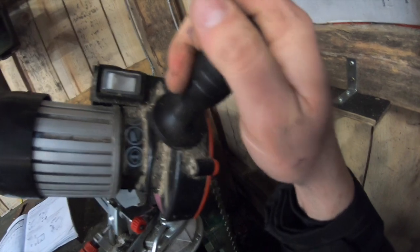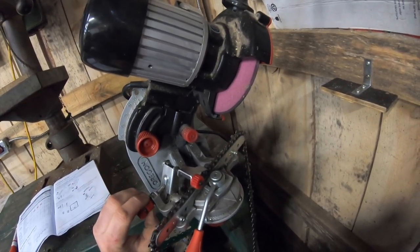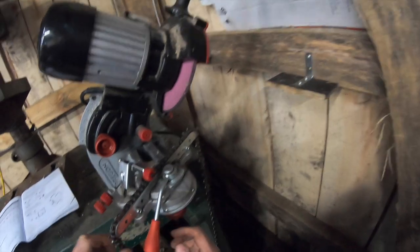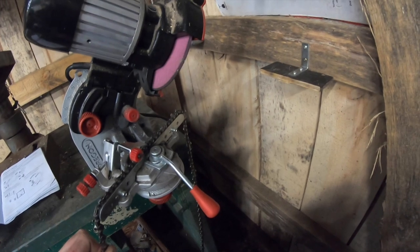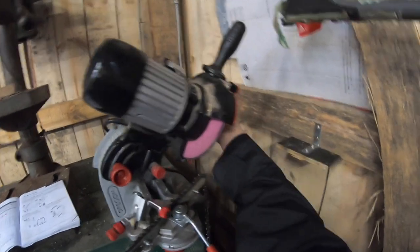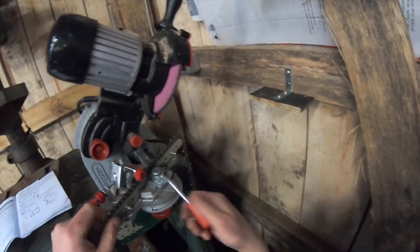Let's say that position is perfect. I tighten the inside knob to lock it in position so the arm can't move out of adjustment. Then I put a bit of downward tension on the chain to pull it back into the arm, engage the locking arm, and we're in position. I'd then turn it on, come down, make a pass — it grinds off a little bit of that tooth — then let go and loosen off.